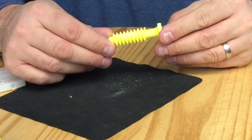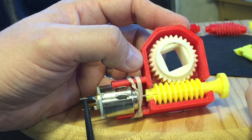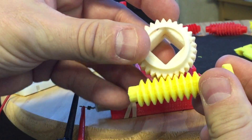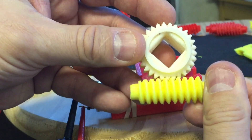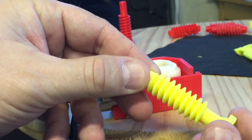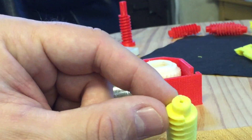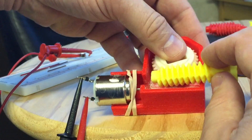Here's the final result and it looks pretty good. Looking back at the original gear, you can see that the triangular teeth are so much better than what I originally was getting with the rounded teeth. The acetone method worked pretty good — I got a pretty good gear out of it, but I just didn't put enough all the way across it, because I got splitting down where the motor is. So it never fully hardened down there — I don't know if I didn't put enough acetone or if I just didn't let it dry long enough.